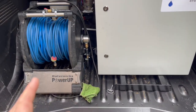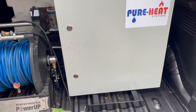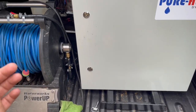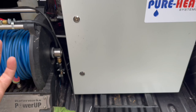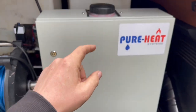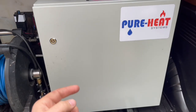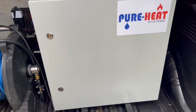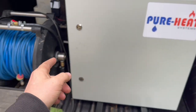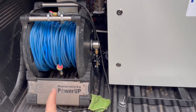You hear about a lot of horror stories of people's batteries getting wrecked or constantly needing services for the heaters. These heaters like to be running continuously, okay? So if you're not recirculating the water and pulling some of the heat out of the heat exchanger, when the coolant loop reaches 80 degrees, the unit shuts off completely until the coolant drops to 60 degrees, at which point it kicks back in. Now when that unit cuts off at 80 degrees, your water is going to go really cool coming out of here, and you're not going to have overly hot water anymore.